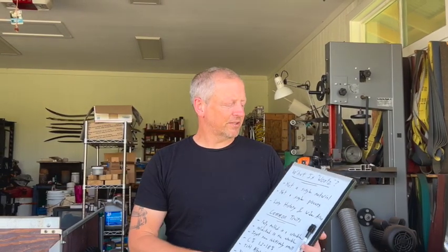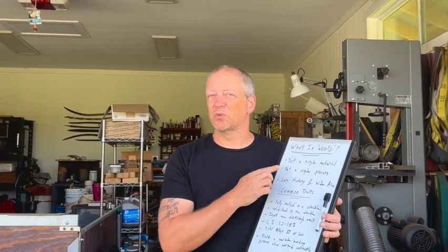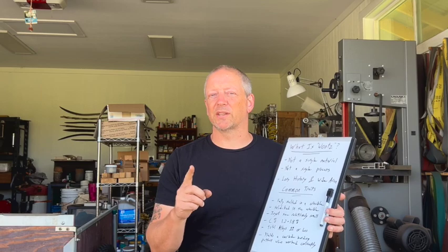So first, most importantly, not a single material. Wootz is a catch-all term that originally was used for historical materials, and those historical materials weren't produced with just one single process. There were a couple different ways that they were made. Crucible sizes varied, furnace types varied, number of crucibles fired at one time varied.